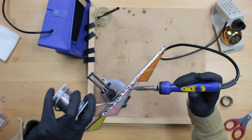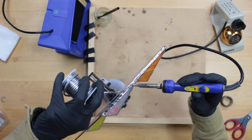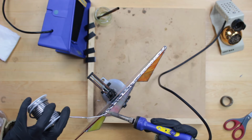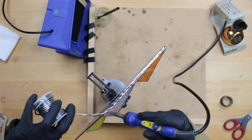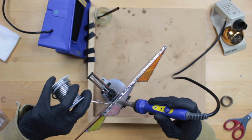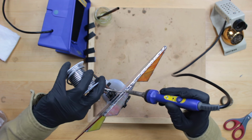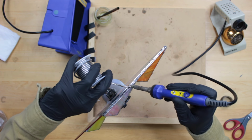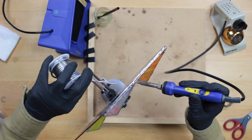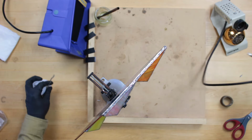Those flaps, the copper foil that flaps over, you can just pull solder from the top, and there's usually enough to just cover that spot. Yeah, this one will fill in right now. See how it looks. I'm gonna come back to this. I don't want to heat it up too much. Scared it's gonna break. So go ahead and we'll just let that sit. It's probably hot enough right now. Too hot right now.